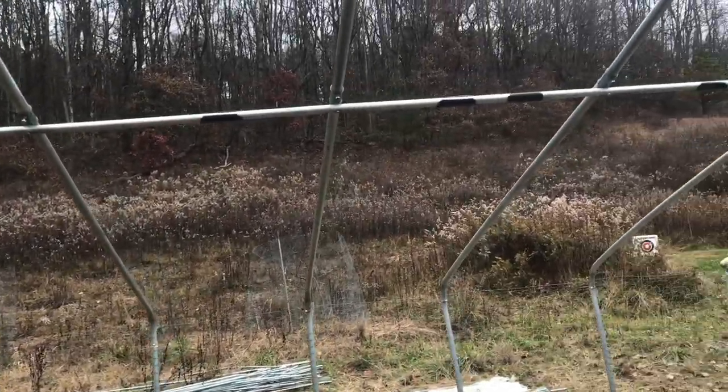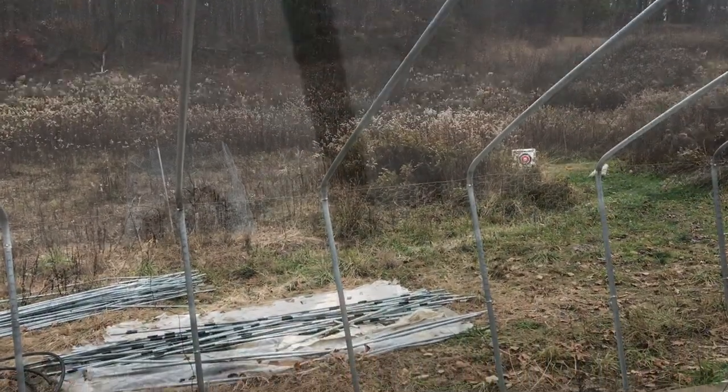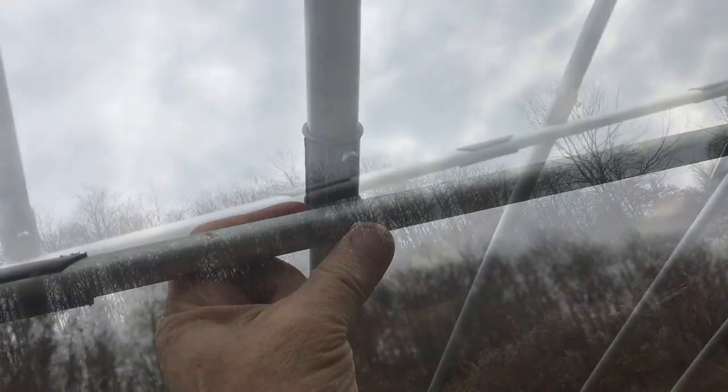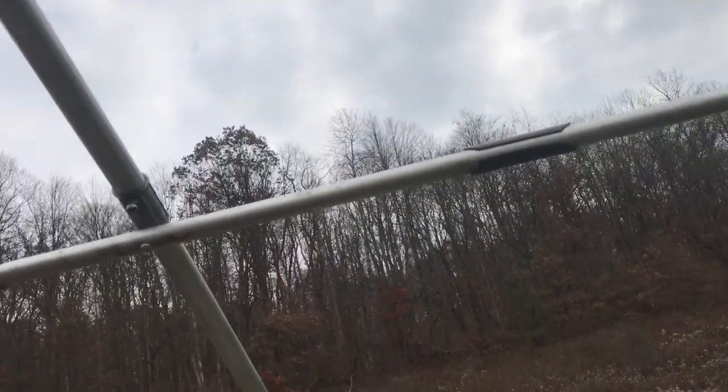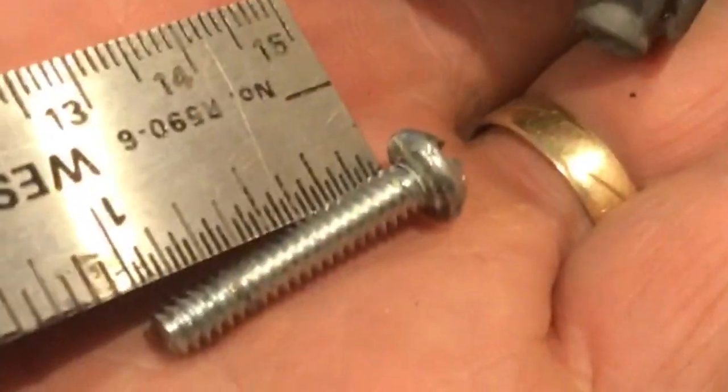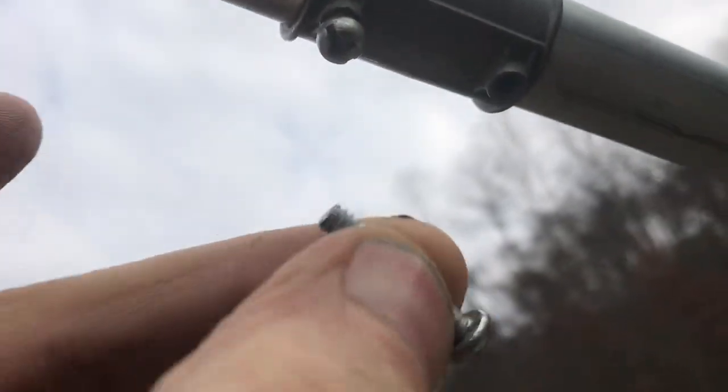Because conduit is so low cost, people use this stuff to build all kinds of structures. In this video, I'm going to show you how to make a cross brace with only one screw. This is a one-inch 10-24 fastener, and it threads right into the existing conduit. There's really no modifications that need to happen.